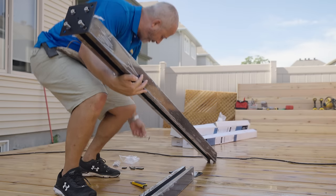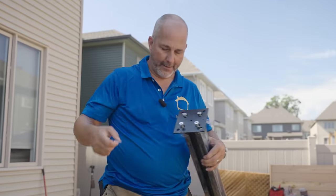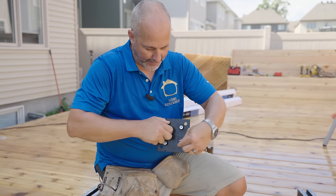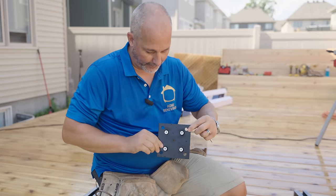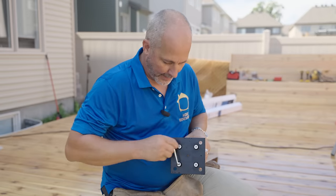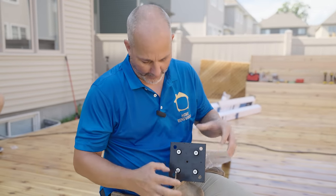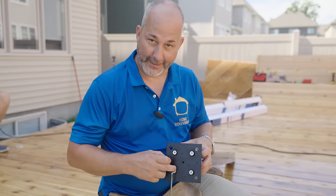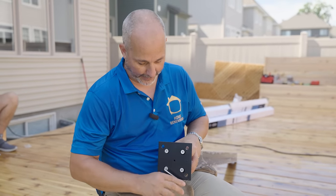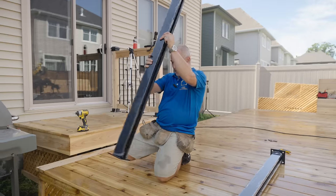All right, ready. I don't even know if this is the right size for this. Yeah, just a word of warning. Whenever you're working with things that are machined like this, do them as much as you can with your fingers, all four of them, before you pull out these kind of drivers. If anything is mildly off in the manufacturing process, once you get the first screw in a plate nice and tight, everything else is gonna be shifted and adjusted. You'll never be able to get the other one lined up. Now we got it going. We're gonna tighten it up real good. Alrighty then.